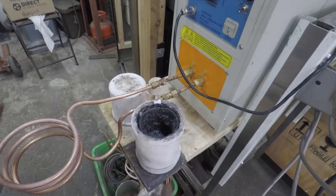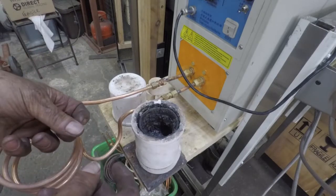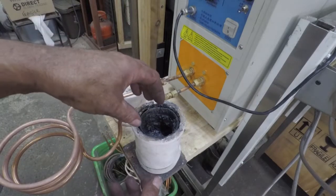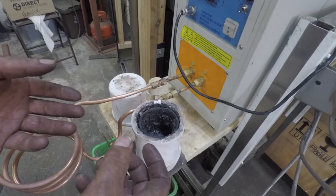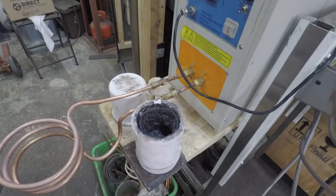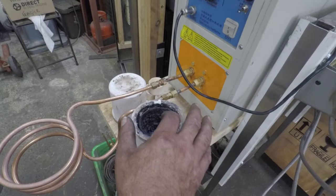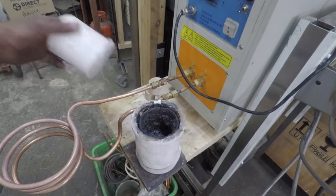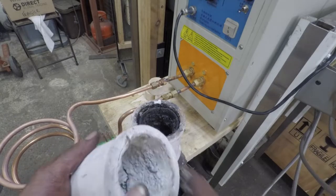Another set for the other half, so I can squeeze them together, put the clay in, press down a plug or pull down a plug with bolted threads and really squeeze the clay. I've made various clay crucibles with not much success — you need to really pound it if you're using a former that you hammer. The idea of not using graphite is that with iron you don't really need it.